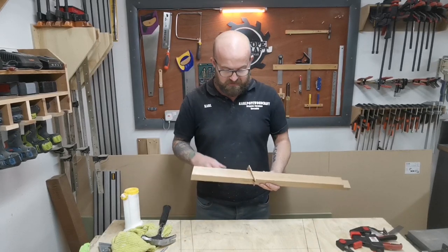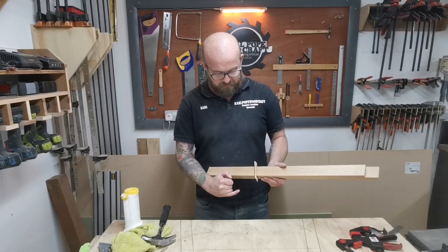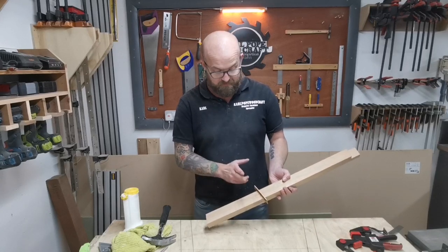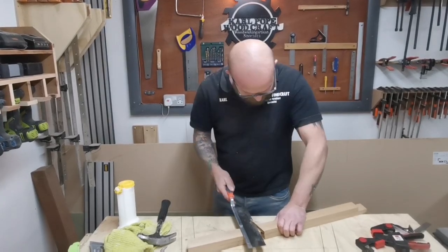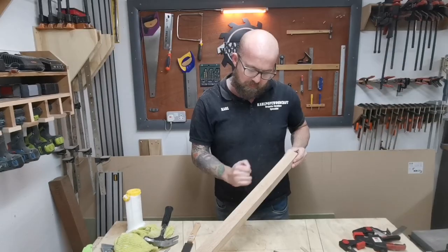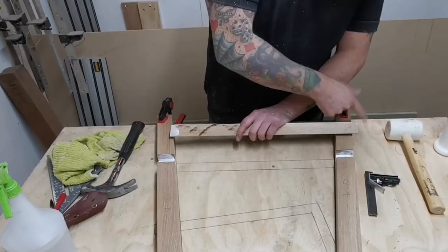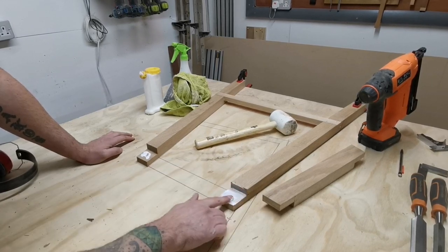Well it had to happen eventually — a mistake. I was meant to be cutting this mortise in one direction but I've cut it 10 degrees the wrong way. So what I've done is cut a piece of oak in the same diameter as the kerf of the blade, glued that in, and now we can cut the correct mortise. It would be better if the grain was going in the same direction, but I think when it's sanded down and the finish is applied you'll barely notice it unless you know. To finish assembling the frame we glue and brad nail everything into position — this way we don't have to wait overnight for the glue to dry and can crack straight on with the rest of the build.